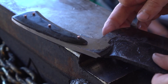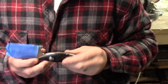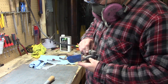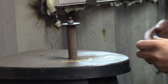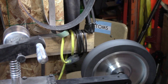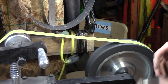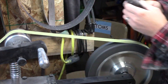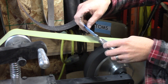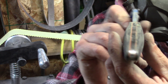Here we can see how Steve has mounted his scales — he used copper rivets and peened them over. It looks really classy. After glue-up the pins are still sticking out, so those need to be ground flush, then we do the final cleanup on the scales. I'm using a Foredom here to get the profiles nice and neat and smooth, and back to the oscillating spindle sander for a bit of touch-up. Then I'm using fluted belts — they have waves on the edges — they're really slick because they don't bite in when dealing with contours. I'm finding them super handy for profiling scales and getting inside curves. I use a one-inch belt first then switch up to the two-inch belt as I get closer to the end.